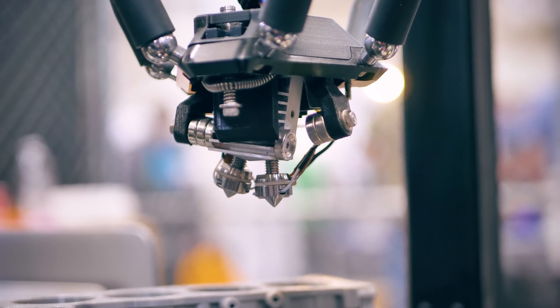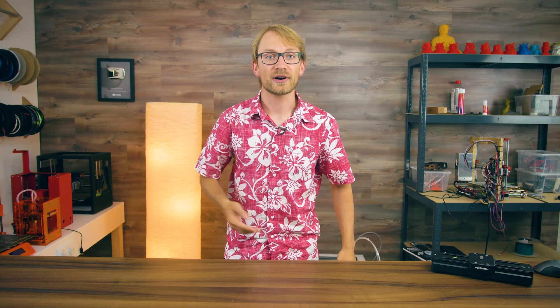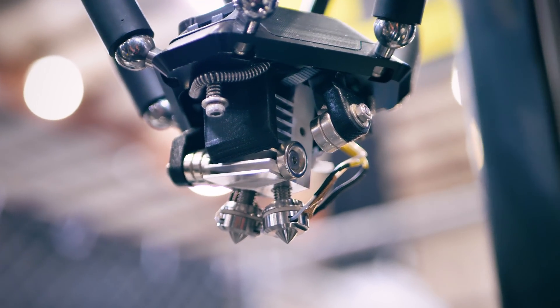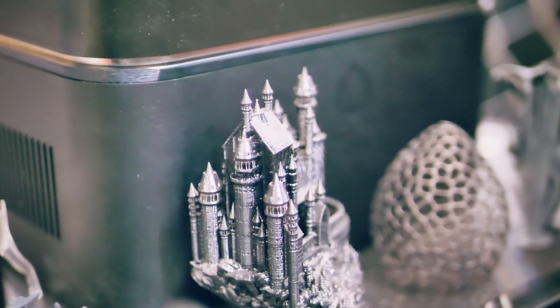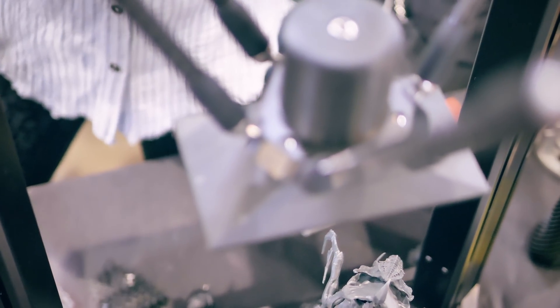Speaking of the hotend, that is quite special too. They've got a dual-swiveling hotend setup — almost like Ultimaker lifting one of their hotends in the 3 and S5, but in a single block and, I think, better restrained on the Atom. It snaps into place magnetically. The Atom3 is also an SLA 3D printer. With the optional LCD VAT upgrade, you can instantly turn your Atom3 into an SLA fabrication machine — a resin 3D printer.